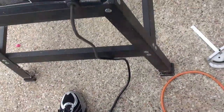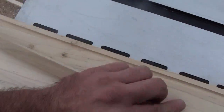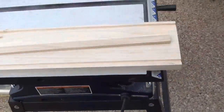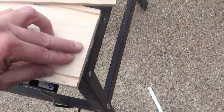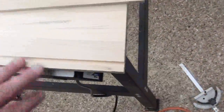I kind of want it that way though, because I'm making a box, and if that's fitting tight, a little rubber mallet action to put it together, it ain't going to come apart, especially with a little glue in there. I'm going to leave it. Alright, got my 2 grooves, got my 1/4 inch grooves. Now I need to make a 1 inch width groove and another 1/4 inch groove, and I gotta go measure out where they're at. Back in a bit.